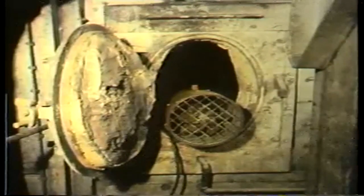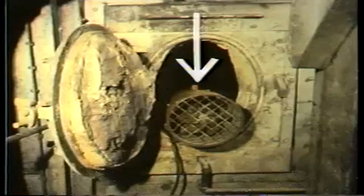While tools like the ultrasonic measuring device are helpful, the most important ones are your eyes, ears, and hands. Look for problems, listen for running water that indicates leaks, and feel a tube surface to determine its condition — sometimes you'll feel things that your eyes have missed. Remember that safety is important during all phases of fireside inspection. Make sure there's adequate ventilation in the boiler; one way of doing this is to set up a fan in the inspection door like this.